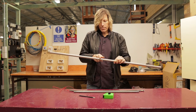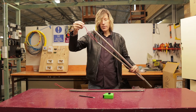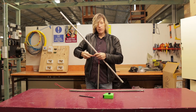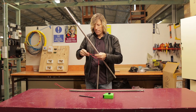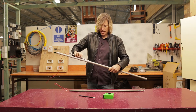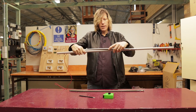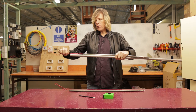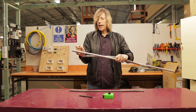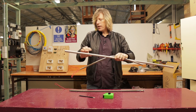So I've marked out my spot — this is where I want to bend. I take my spring with my wire at the end, measure it out, and put a little kink in the middle of the wire. When I put the spring in, it'll know where to stop. So there is my mark; this is the middle of my spring. I'll extend out the wire and put a kink just like that. This is important especially if you're doing a bend in a longer piece of conduit.